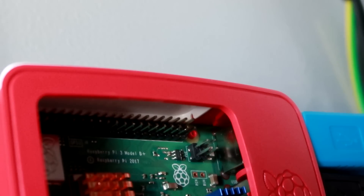You can see this contact bar — this pin out you have in the Raspi. There are some pins available which you can use to restart the Raspi. You can connect a little switch and if you press it, it does a restart. But this is not the correct way either, because it prevents the system from writing all the information back on the SD card before it restarts. This is more like the reset button on your computer — if something is frozen you press reset. But there's nothing for a proper shut down. Pulling the power is really the worst idea you can do with your Raspi because it corrupts your data over time.